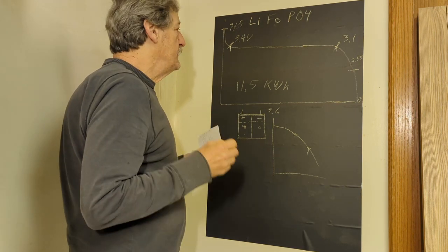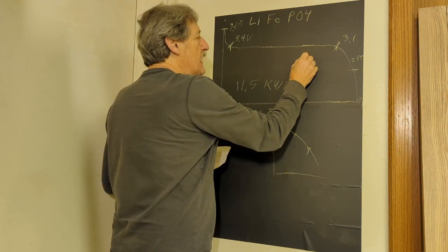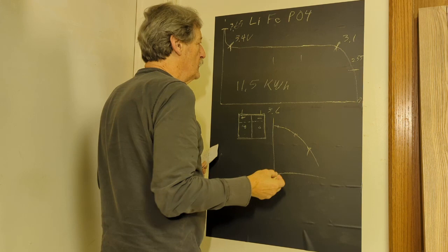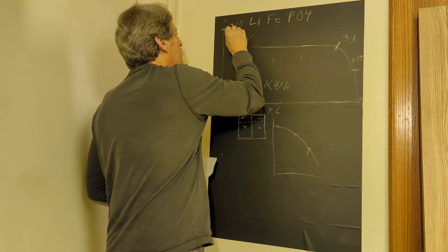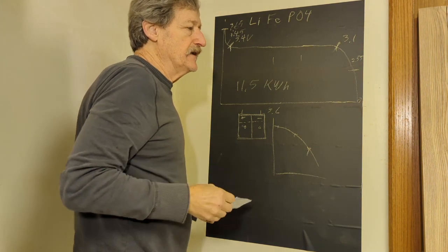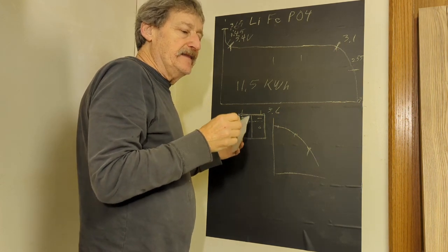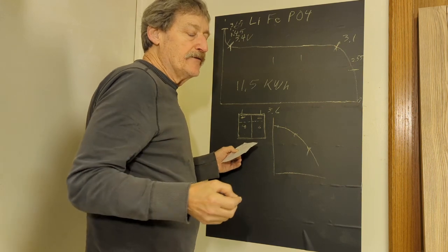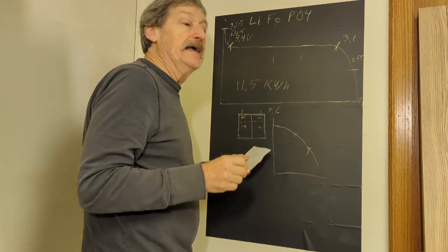So, to review again, the batteries took so long because there is so much power. I don't know where these batteries were, whether they were here, here, one could have been there, I don't know. However, they've now all been taken up to a little bit higher than here, 3.45, but they're balanced. The current drawing went down to 0. So that's what will happen when it's connected to my solar panels. The inverter will also work along with it, but the charge controller will make it pull in 3.4 volts until the amps drop off to 0, and then my battery pack will be, in essence, fully charged.